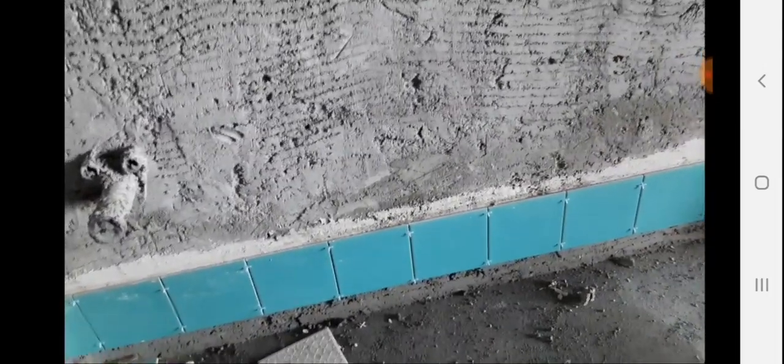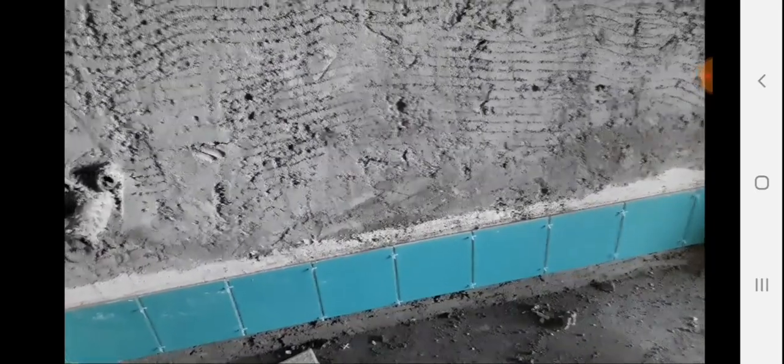And one another thing is, in the corners like this and the opposite corner, you should fix the same piece, same size, like here and opposite here, and this wall, opposite this wall. So this idea is called X. Sometimes you follow the X on the floor, and if the floor tile is the same size, the lines will be parallel to each other, so the opposite wall will not disturb your line in the flooring. So this X you can also follow to make good, quality work.